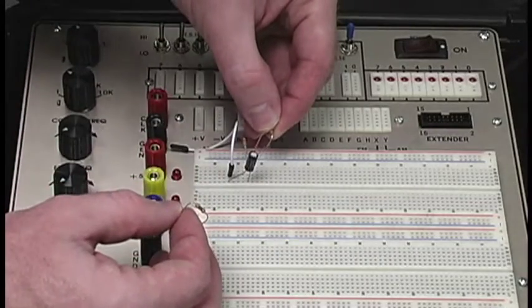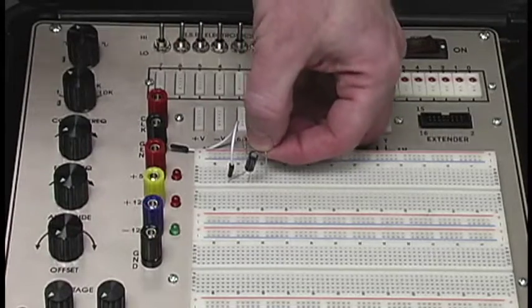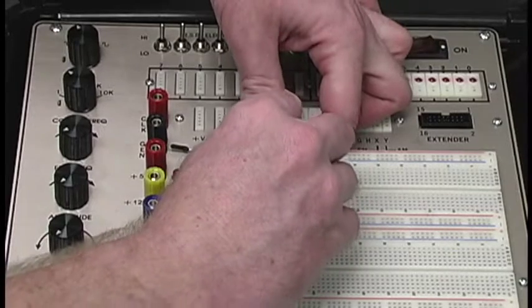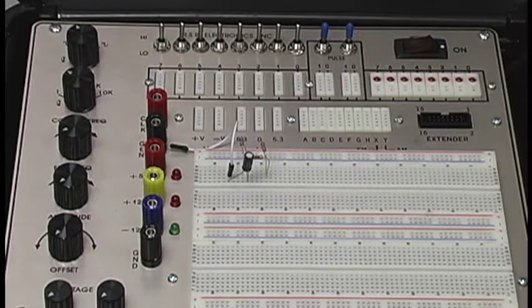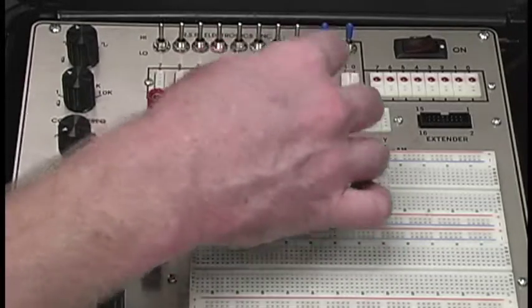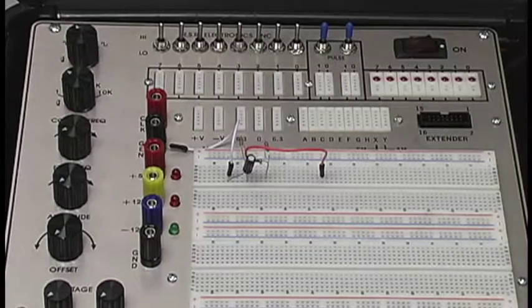We're going to put one on our negative rail and then put it right by here on its own, because what's going to happen from here is we're going to put our next resistor on that same row and give us our 27k ohms into that node you saw, now going to ground. And then last and certainly not least, we're going to be putting our BJT in there. But since we're also going to make other connections from that BJT, we're going to put a nice little wire right here on that same row and then bring it out here away so we can now connect the BJT.